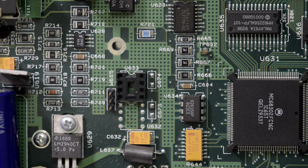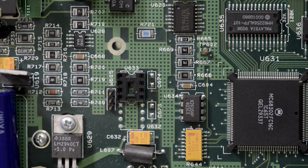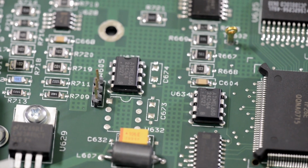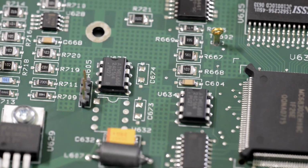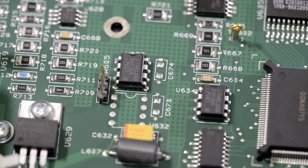Also, I was always wondering what that socket is for on the model 2001 digital board. Seems like it's storing extra calibration constants and values which are used in 2002, because on 2002, let me get focus, sorry, here we go, two I2C Atmel 24C16s, exactly the same locations, exactly the same ICs.